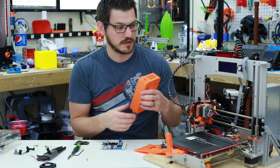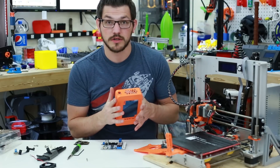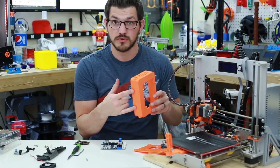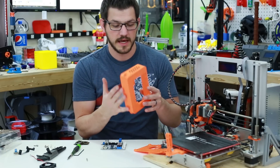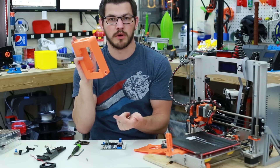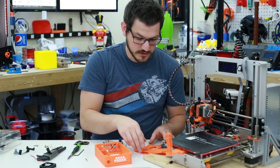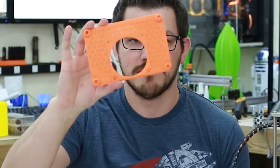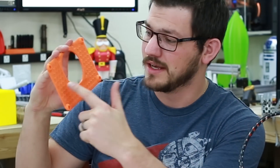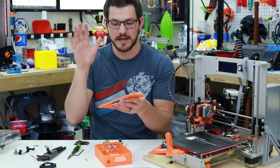Sadly, he did not add any mounting spots to mount this to the printer. The holes in the printer are already tapped, but I'm going to mount this flat in the center of the upright here — drill two holes in the frame, match it up, drill two holes in the case, and just use nuts and bolts to hold it on there. You can see inputs here, here, and here where all the different parts hook in — the bed, motors, extruder, everything comes right at the top. The stock cover prints absolute garbage — there's a weird honeycomb because he just stacked a solid layer on top of the honeycomb lid.